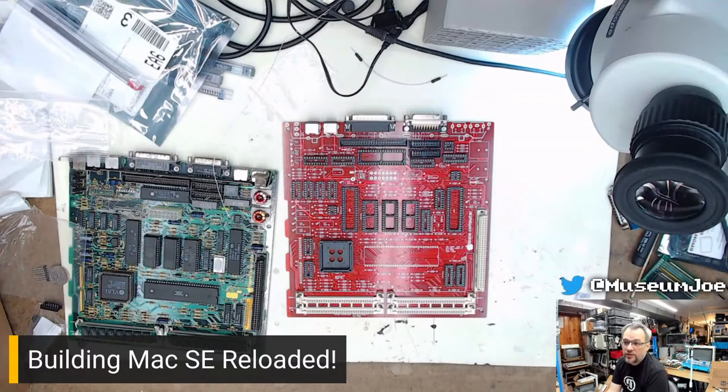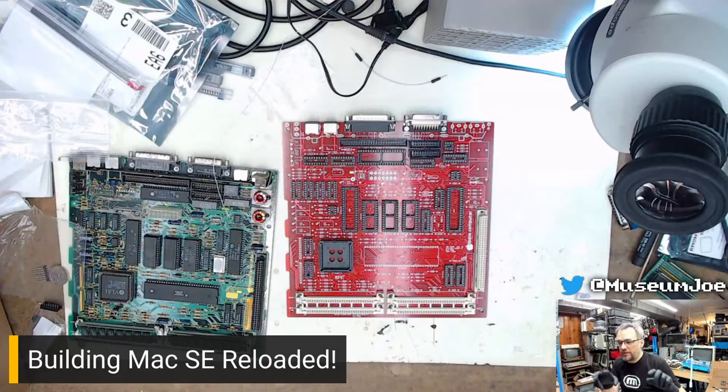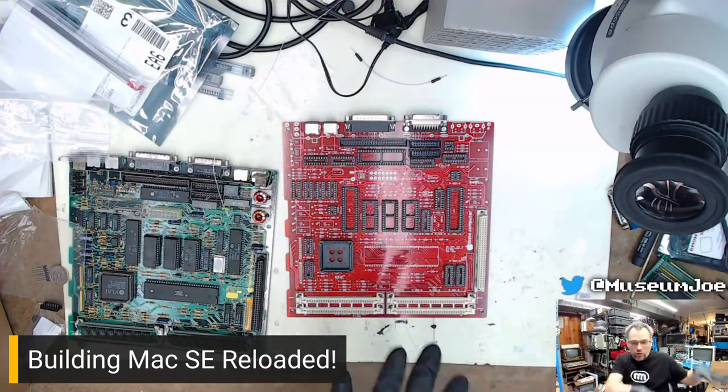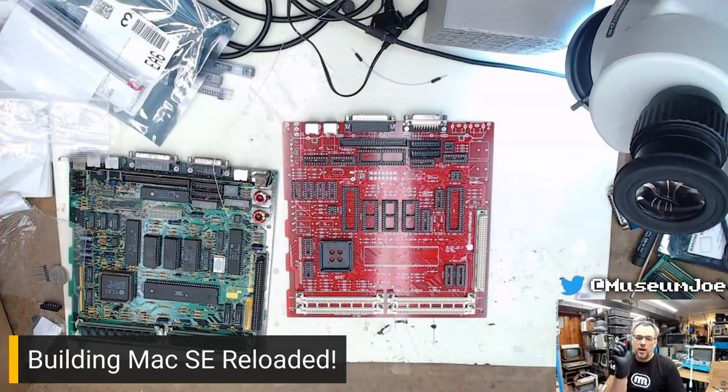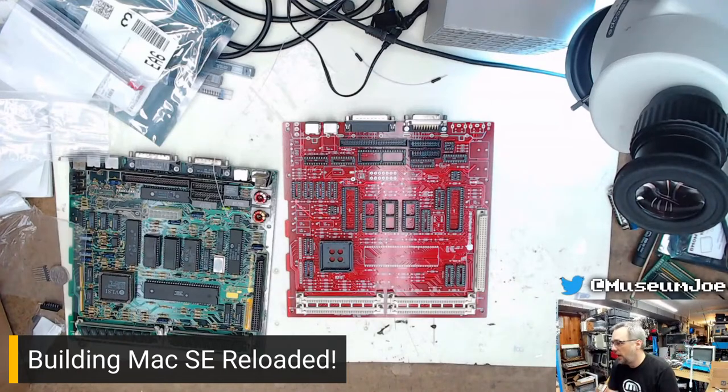Normally, I would solder the small components first, the small axials and radials. Usually the idea is you go from whatever's not as tall on the board up to the taller components, because the theory is that when you lay the board flat with all the components at the same height level, the gravity of the board holds them all in place. But I use the pin bending technique where I flay the pins out, not all the way over, just enough so it keeps it in there. I don't really worry about it.